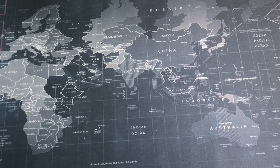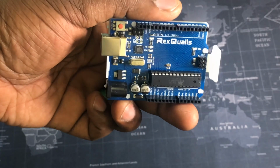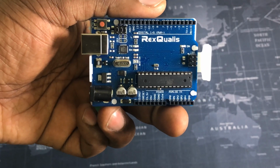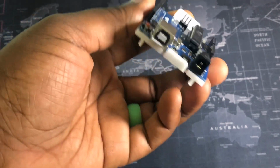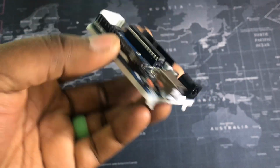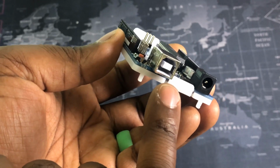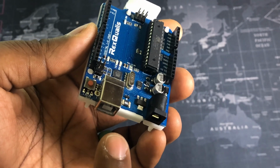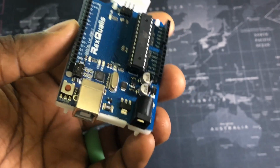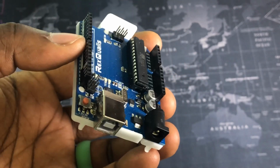And the other project that is currently running is my mode selection for launch control, boost control, etc. on the MR2. So that's all powered by this simple Arduino. This Arduino right here costs $10 on Amazon, and it's available on Prime. So just a quick overview. How do you power this Arduino? You have two options here. You can power it by USB 5 volt. So that's right here. You can just plug this into your laptop and that will power this board up. That'll allow you to write code directly to the Arduino. Once the code is written to the Arduino, it will execute in an endless loop, and you don't have to keep uploading the code. The code is written to the EEPROM here. So that takes care of all the execution.